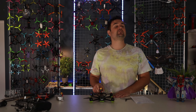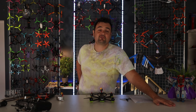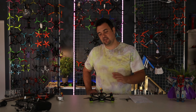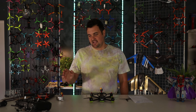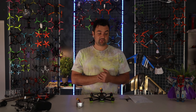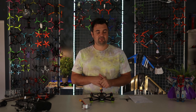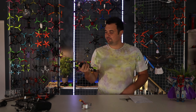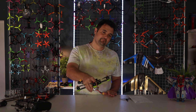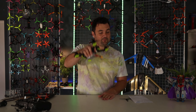So there are 10 reasons why your drone might be flipping out on takeoff. And here's a bonus — number 11. I felt extremely silly about this one. I was with my mate Granger and we built this little micro quad. I'm giving it a hundred percent throttle and it's just spinning up, I've checked all the steps — it should be flying. I'm absolutely giving it to this little quad in the garage, and all of a sudden it took off at a hundred percent throttle straight into the ceiling, leaving four marks. The reason was a Velcro battery strap on the bottom had stuck to the rug in the garage. That's why it wasn't taking off — as soon as it broke that Velcro connection, it went rocketing into the roof.